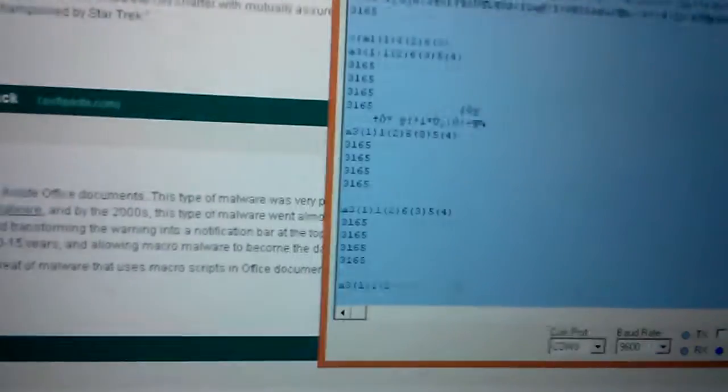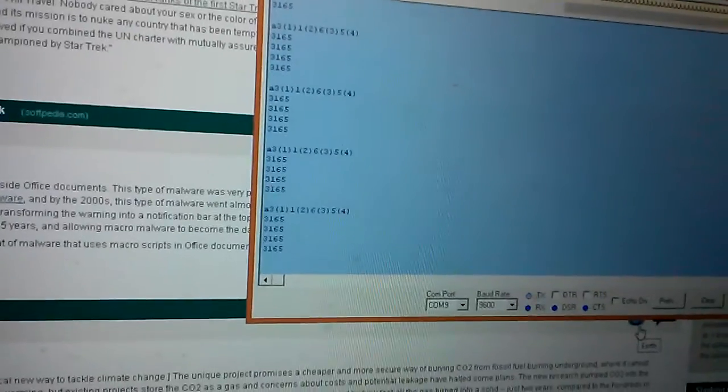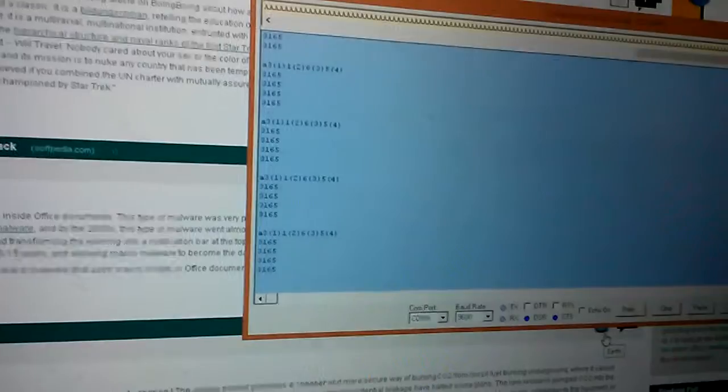And you can see now that the data is coming in again. Now, when I keep requesting the data, know that it's coming in a lot cleaner. This is because the oscillators are overriding the noise, so we're actually going to get less noise with more data rate, up to a point, obviously. You can see here 3165, and the other one is dead, so it's going to give you a bunch of zeros. Let me clear the window so you can actually see it. There we go.